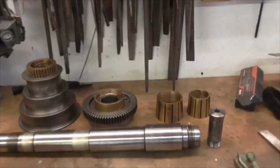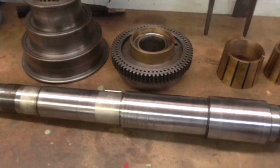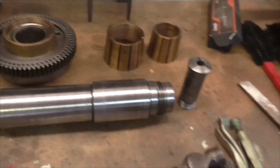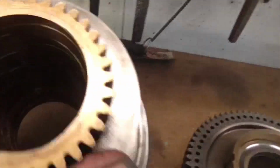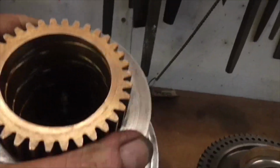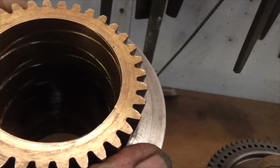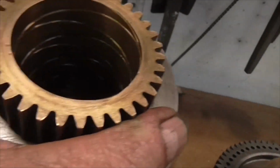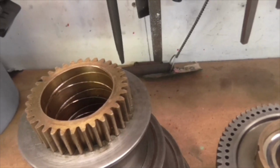Friday, 5 o'clock, just gone. Right, we have some clean components. Not assembly clean, I hasten to add, but they're cleaned. What am I not happy with? I'm not happy with the bore of that. All the oil slots appear to be, the oil ways, should I say, they are oil slots really, are full of oily varnish, so that's going to have to be the cellulose thinners and the toothbrush job